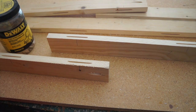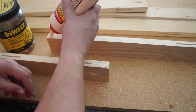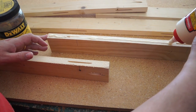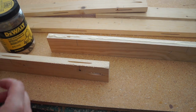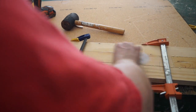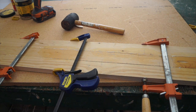We are ready to glue. Put on a thin bead, spread some into the holes, roll it out. We'll do that for all of them and clamp it up. I'm all glued up, so I'm going to wipe off the excess glue with a damp cloth. Then we can move on to the other sides.